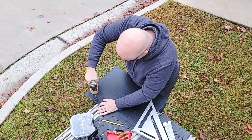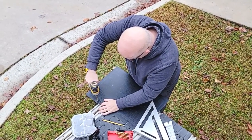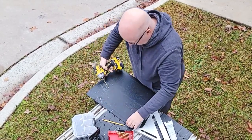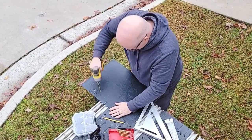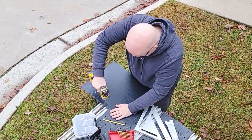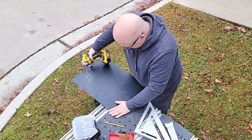For the solar panel, we're going to put two screws — the instructions call for two screws, but we might put three, and we're going to pre-drill. What you want to do when you're installing the solar panel on the outside is make sure that you're avoiding the actual solar part which is producing the power, because you don't want to interrupt the power going through that. If you drill through on the outside you're fine.